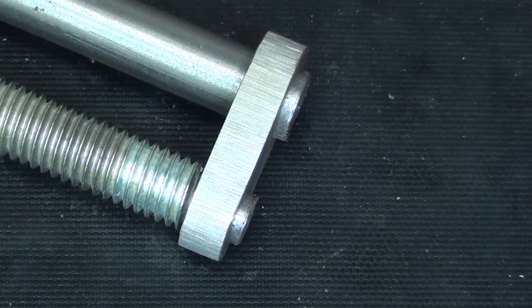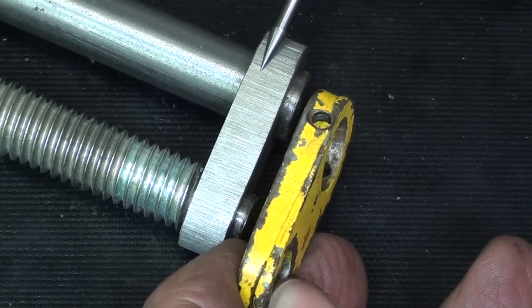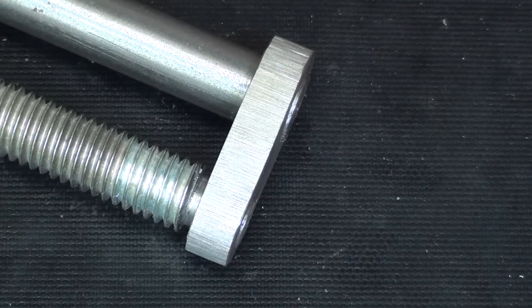All I need to do now is lay out that 1/8 inch hole there, which I will do off-camera, and drill the 1/8 inch hole all the way through. But again I'll put a temporary pin in there. Looks pretty good. And bingo! What's next? Next is the crank handle, and this is the original.